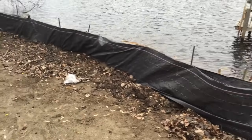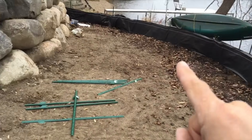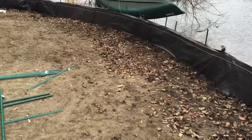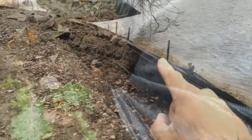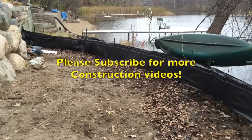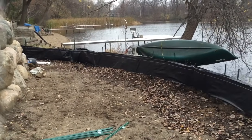We're getting the new silt fence installed. Important point — no gaps. Look at the bottom of this silt fence: it's all been dug in six inches deep, there are no gaps. A lot of times you'll see a silt fence flopping in the wind — that's not properly installed. Also, green fence posts every six feet. We're reinforcing this silt fence with fence posts because this is steel silt fence. For standard silt fence, the wood stakes that are included are adequate.